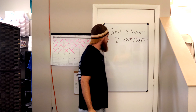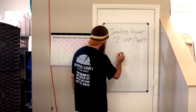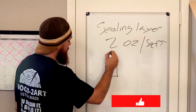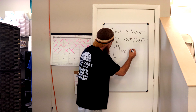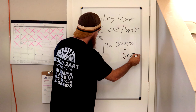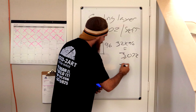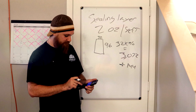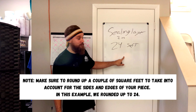The first one we're going to go over is how to figure out how much we need for a flood coat. Now, the sealing layer doesn't need that much — you're just trying to get it to absorb into the pores of the wood, any small cracks, tiny little defects. Because if you just try to go straight for the flood coat and mix up your eight ounces, you're going to waste it — there are always going to be spots that keep popping bubbles, and you can only mess with it for so long before you have to step back, and you'll be left with little bubble piles and have to sand it all the way back down. So it's easier to mix up a small amount of resin, do the sealing layer, sand back, and then go ahead and do your flood coat. Generally speaking, you need about two ounces per square foot for the sealing layer.